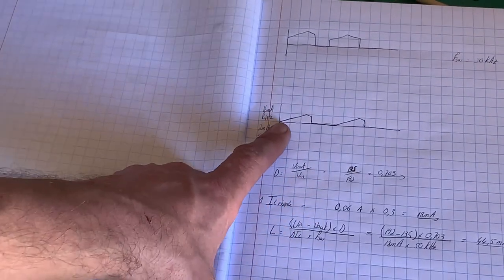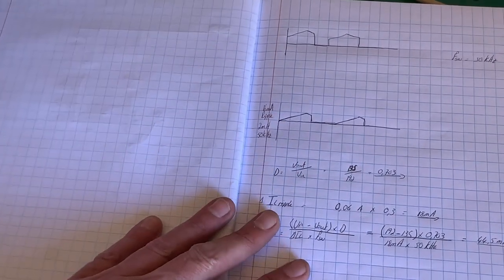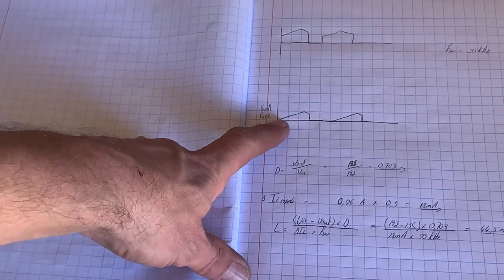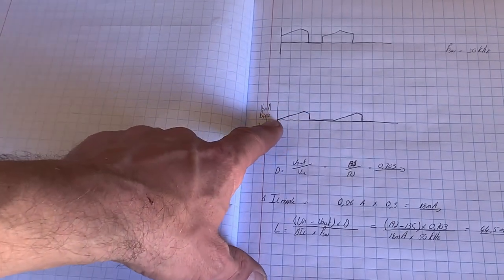Correction, sorry about that. There's a 2 millihenry inductor in there, and that is going to be far too little. That inductor, 2 millihenry, the board says it will handle 425 milliamps, so let's say 30% of that, so easily 300 milliamp ripple. Well, if we put our little 60 milliamp in, what is going to happen?